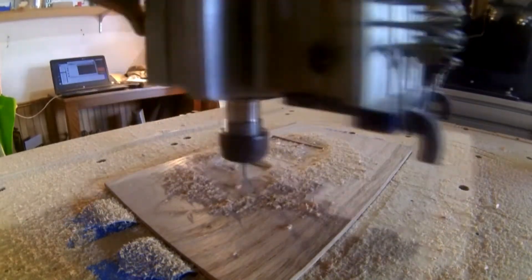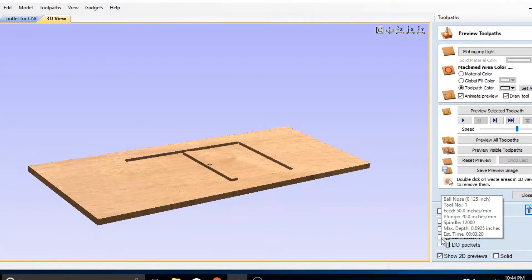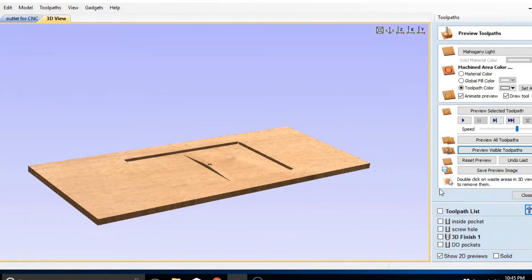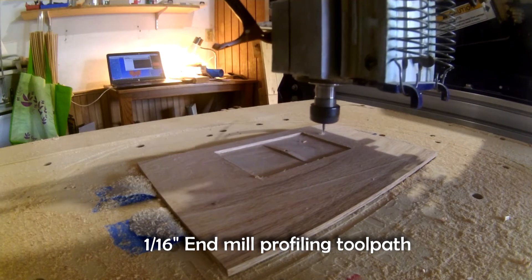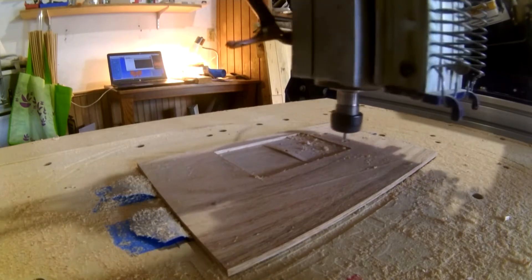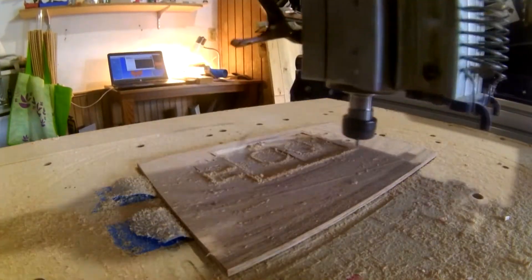For more detail on these CNC cutting operations you can watch the accompanying tutorial that I made — there will be links at the end of this video and in the description. Sorry about this shot; I forgot to hit record so you have to watch the virtual version instead. For details as small as the ones in this model it's nice to have an end mill with such a tiny diameter. The sixteenth of an inch was really able to get into all the little nooks and crannies and I didn't have to do any touching up at the end.